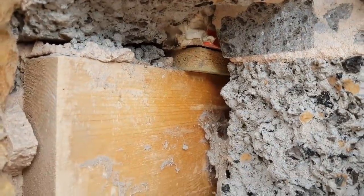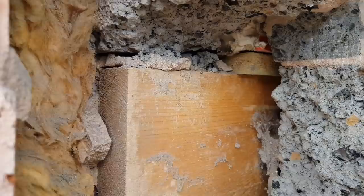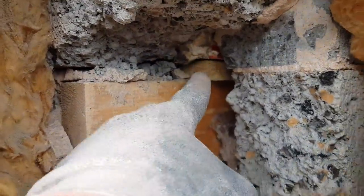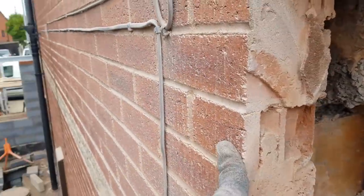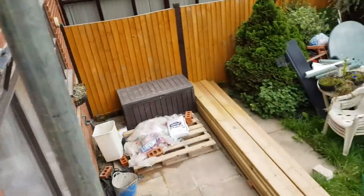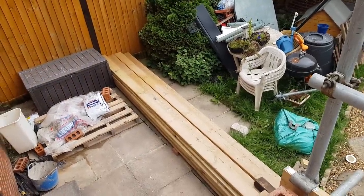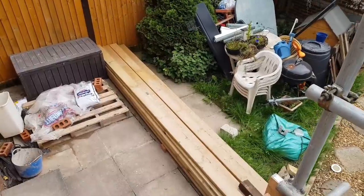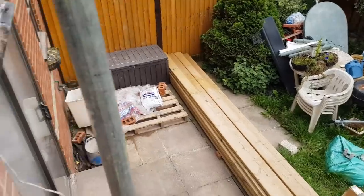There we go. I thought my floor level — top of floor — so I've got to transfer this top to there, transfer over there, and then I'll be able to measure down, find the cut. I've got 6-inch timbers plus 22mm of floor board, so I'll add all that together and figure it out. Best get a pen and paper out.